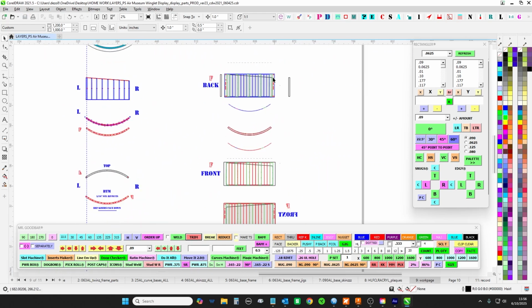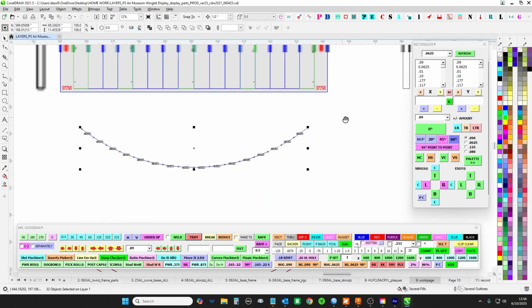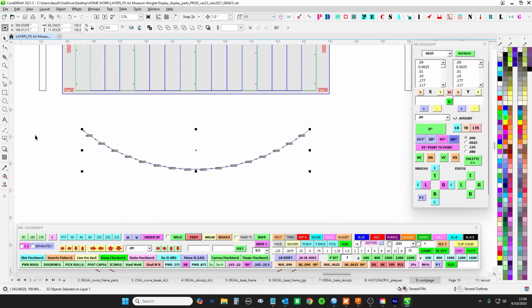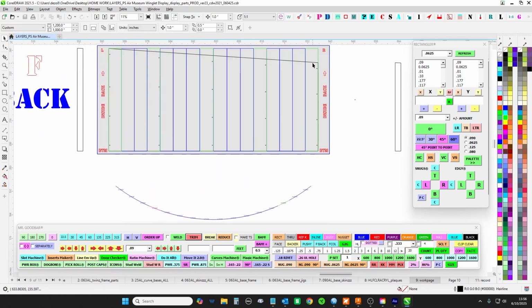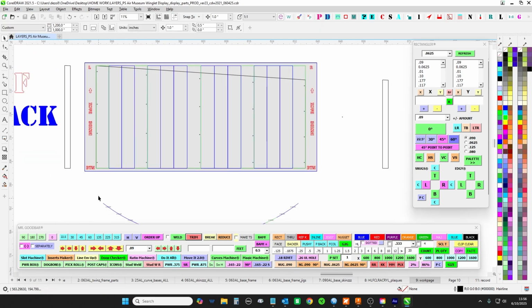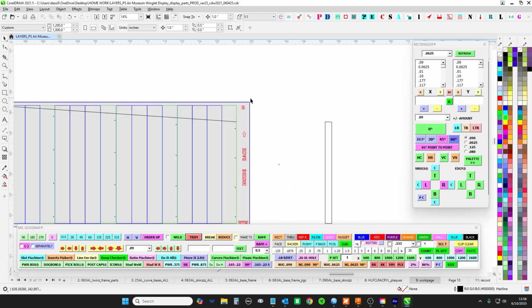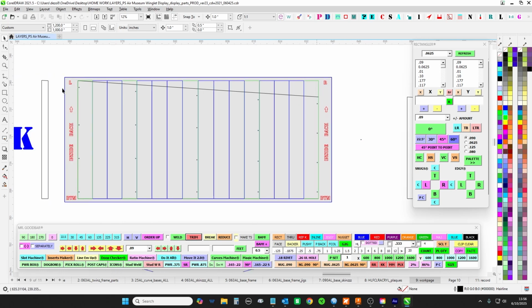So faces, I went ahead and gave you the layout of the face. I didn't need Fusion for this. My macros do the length of the curve and all that, so I got those down. You can see where the face actual length is here, and I have it ghosted here. Now, instead of giving you the exact shape, which would be a really hard target to hit, plus when you start the roller, you're going to lose like an inch. It's always funky. So I gave you 4 inches on both sides just to get it started left to right.